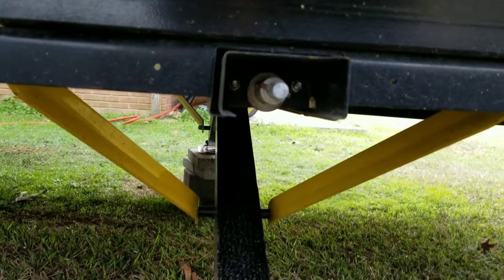I'm not a professional — I just know a little about a lot. One thing you want to make sure of is that you're on an I-beam. You can see right here — that's the I-beam that runs the entire length of the trailer. It's where the springs attach for the axles and also where the electric jack mounts. Make sure your blocks are directly beneath these I-beams.